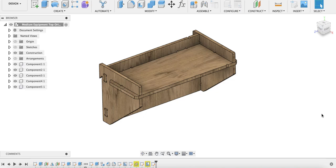So the first thing you want to do, of course, is pick your material and then measure its exact thickness with a set of calipers. Okay, so for example, your 1/2 inch plywood could be 0.475 inches, let's say. The next step, and this is really important, I highly recommend it, is really the key to making the most accurate cuts possible.